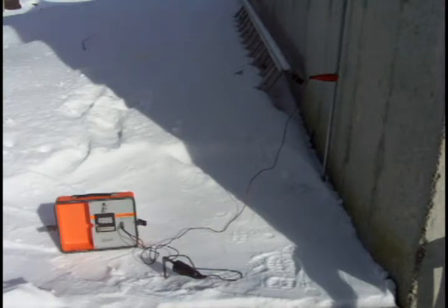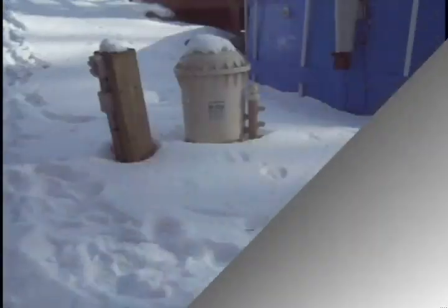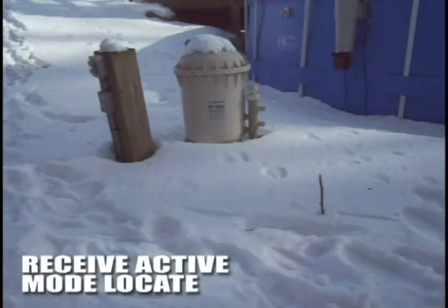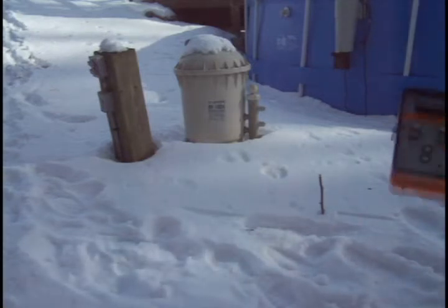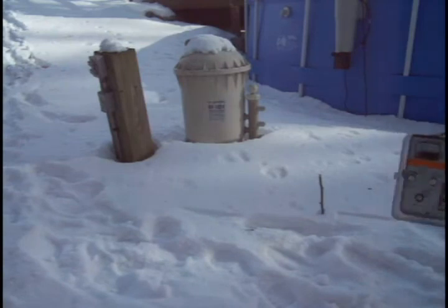The positive end is on a conduit, so it's not a direct connection to the cable — it's more of an induced signal to the cable because it's on the conduit. I'm not measuring the conduit but the cable inside it. So we'll see if we can pick up our signal again. On normal setting, the signal is much stronger because it's more direct rather than induced.